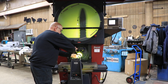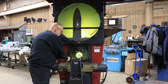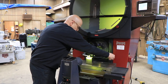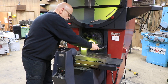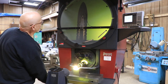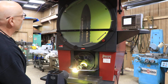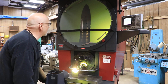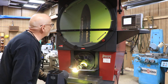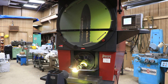I'm going back to my 20x lens and bringing it back into focus. These lights here are your surface illumination — they pull out like that. In the case of this little lead bullet that I happen to make as a hobby, we turn that on and focus it. You start to see a better picture of the bullet and can see all the different grease grooves. For cylindrical parts you can only focus one plane at a time due to depth of field. That's the surface illumination — it looks pretty nice, a bright image on this machine.